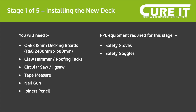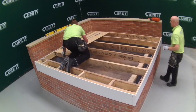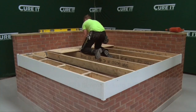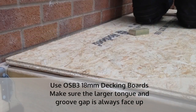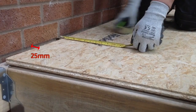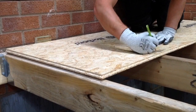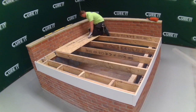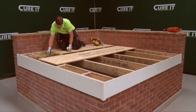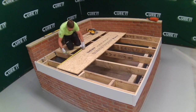Stage 1 of the Curit installation: installing the new deck. The decking must be completely dry when the roof is fitted. Lay the boards at 90 degrees to the joists, making sure that the larger tongue and groove gap is always face up. Leave a 25 millimeter expansion gap between the decking and abutting walls. Mark the joist locations with a pencil onto each OSB3 board as it is fitted and stagger the joints. Use the off cut from the first row to start the next run. Ensure that off cuts are greater than 400 millimeters and they must cover at least two joists.